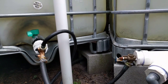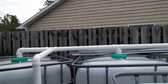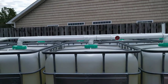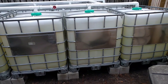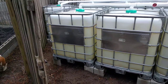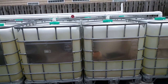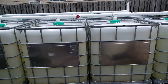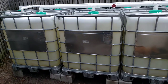I also planned my tanks to be a little further away from the house, as I didn't really want them that close to the building in case one were to break. Think about how much water you have, where it is, and what would happen in a catastrophic failure — what if a tank broke, or a rat chewed through the bottom? Think about the worst-case scenarios and plan for those to ensure you're not creating more problems than you should.